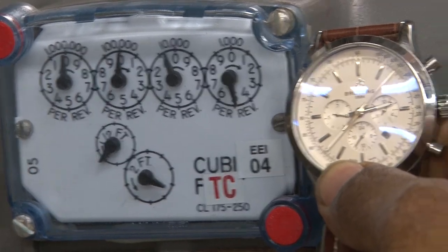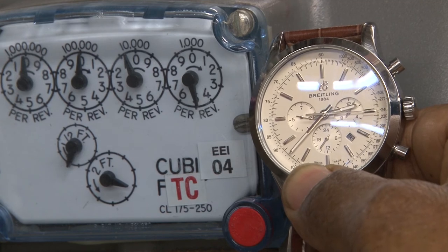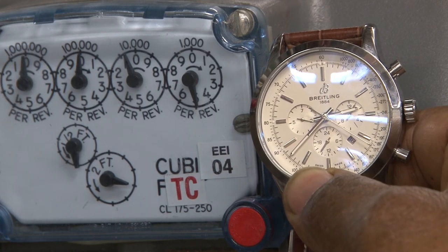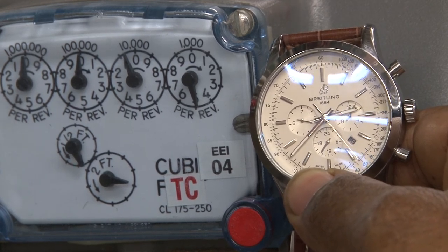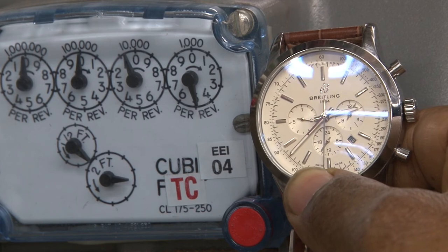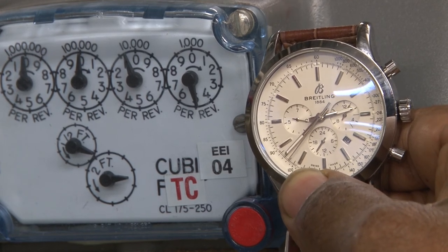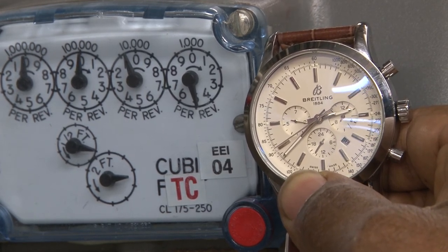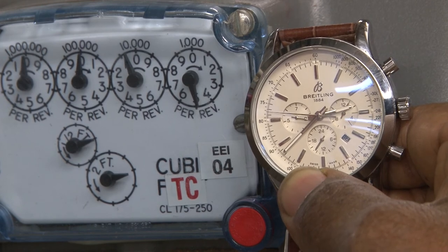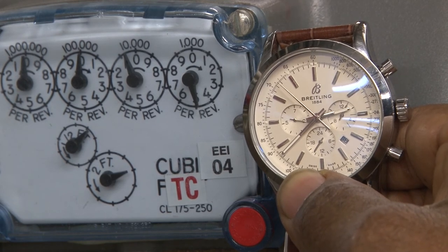And this furnace is a very small furnace, so it's not going to really produce very much, but we will be able to recognize how much gas we use in a predetermined amount of time. So as we run this, it's about 25 seconds, and it moves probably about a quarter of a full turn. The main thing about clocking the meter is you have to be very accurate: a precise amount of time in seconds, and a precise number of revolutions for every dial turn. So far, it's almost one full turn in 1 minute.